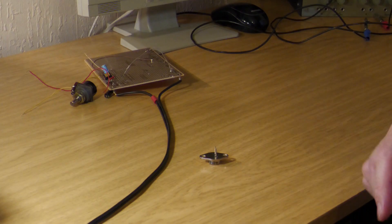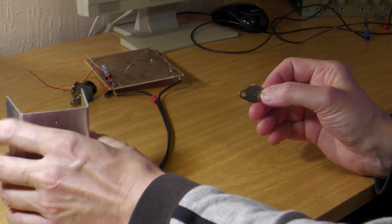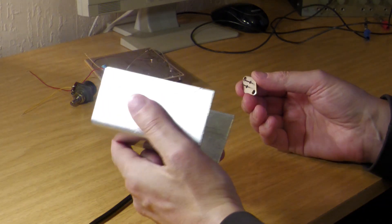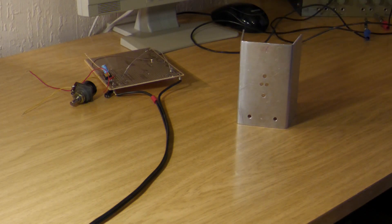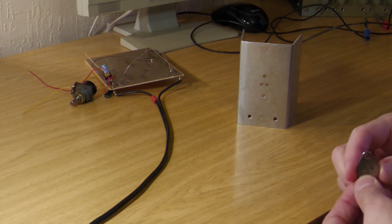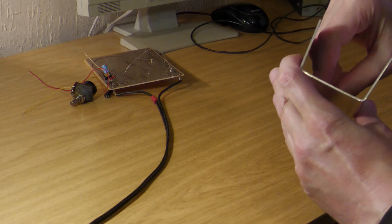Before I build the rest of the circuit, our output transistor will still get a small heatsink — otherwise it will die relatively quickly. I use an old heatsink from an old amplifier. It has the advantage that the mounting holes are already in the right place. The two legs on the transistor are the base and emitter. The collector is directly connected with the housing.